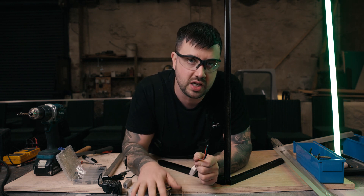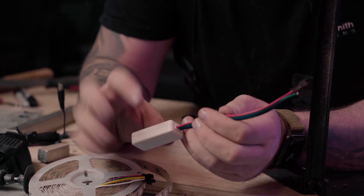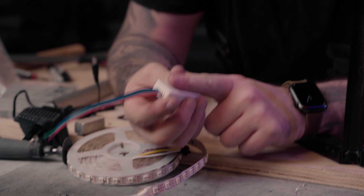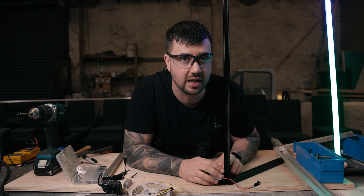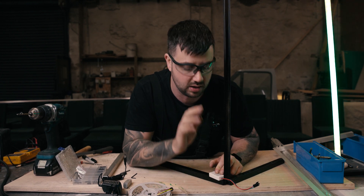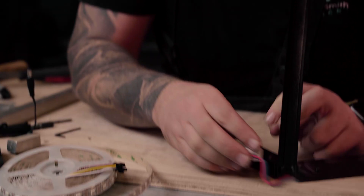This particular strip is the three-wire version — it doesn't need the clock, so that green wire there we don't need; we can snip it off. I'll double-sided tape the strip onto the bench, solder the wires on, and we'll stick everything on. It's honestly as simple as that, guys. Let's go ahead and carve this out.